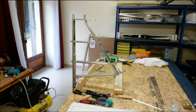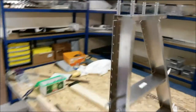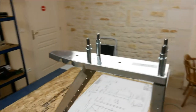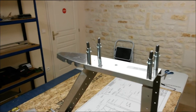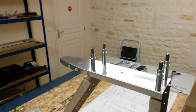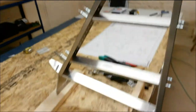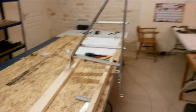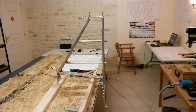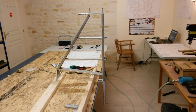The skeleton looks pretty good. It went together reasonably well, apart from the top rib here - the front holes were slightly out of line, so I've had to re-pilot drill those just to get them to line up. They'll be fine once they've been opened out to the proper size for the rivets. So there we go - one tail fin assembly. What I shall do now is drill it out and get it ready for riveting.